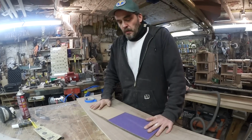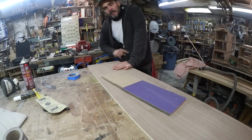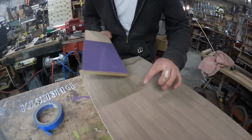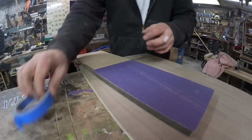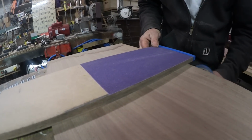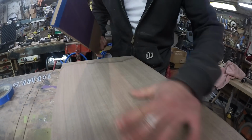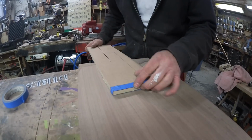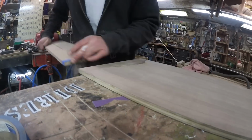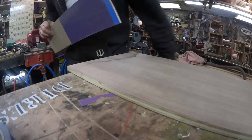A lot of times I like to make a long board if I want to keep things nice and flat. If I have edge banding here on the end of this walnut plywood, or if I want to get rid of this water stain, I can certainly go like this and sand it off. But I'm using the edge of the board here, and it's going to scratch up my veneer. So what I often like to do is cover the end of the sanding block with tape. And now it keeps the end of my block from sanding the veneer up here, and it only works where I want it over here. And I still get the benefit of having a long board and keeping everything flat. So by taping the end of your sandpaper, you're not scratching up the veneer down here where you don't need to.